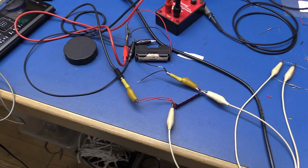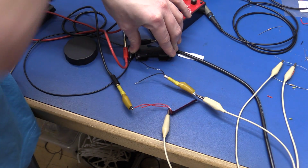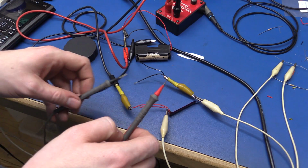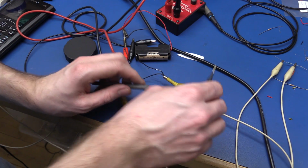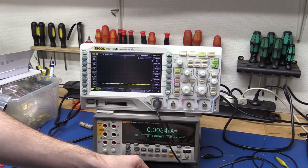I was still expecting the pulses, but let's just do something to get it to regulate. So I got a different one here that I found in the used batteries box. It has 1.35 volts and it should regulate now, hopefully, unless I broke the Batteriser. And sure enough, it's at 1.48 volts now when I use the multimeter. So let's look at the scope.